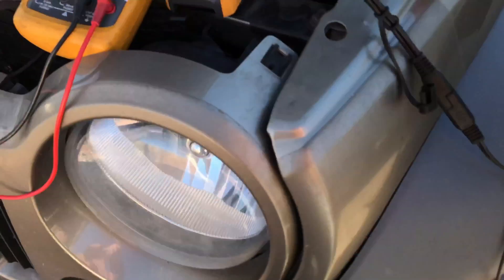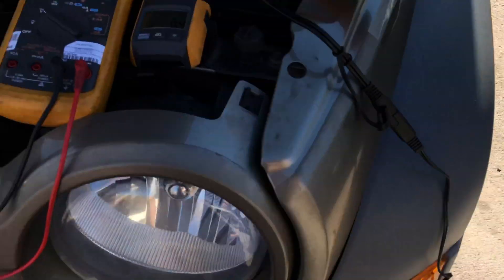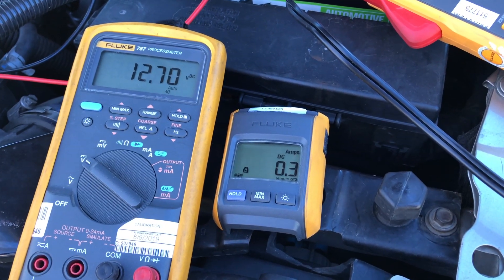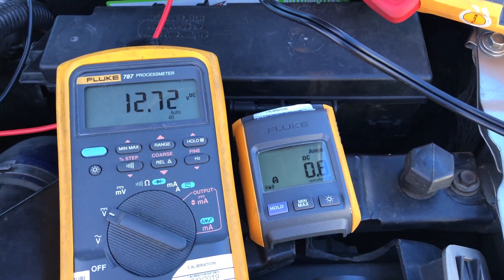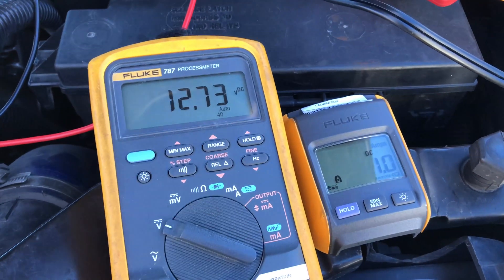Let me play with the angle. Pointing it a bit more upright — 1.1 amps, nice. Back to one amp, now let me try laying it flat to see what happens. Wow — 0.3 amps. That shows just how much angle matters; the cross-sectional area is so different when it's nearly flat and photons are bouncing off. Let me try a shallower angle like I might use in summer — 0.8 amps, pretty close. Going back more upright returns it to about one amp.